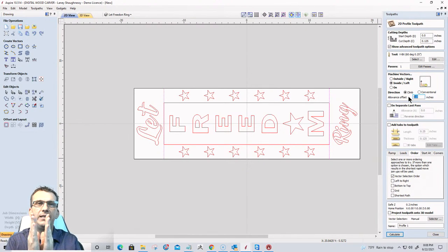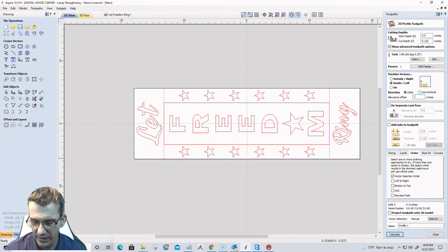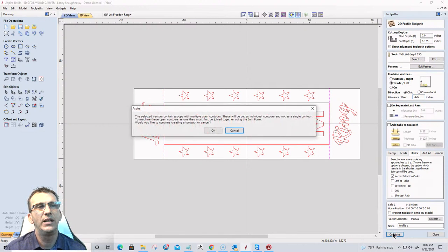This is the important part: how far do I need to step over? One would think that if it's a 60 degree quarter inch V-bit, it's the full eighth of an inch, right? Well, it's not. It's going to be more like a 16th of an inch, but let's start off with the eighth. Since I need to move off the line to the left, that's going to be a negative. I'm moving away from the line, not towards it. Oh, I'm sorry, it's going to be a positive number. If I was going towards the line, it's a negative number. If I'm going away from the line, it's a positive number. Positive space, negative space. I want to go away from the line, so it's going to be 0.125. Now, if I calculate this toolpath,